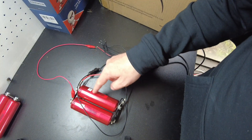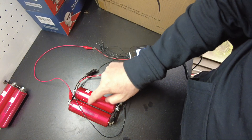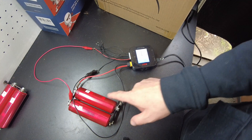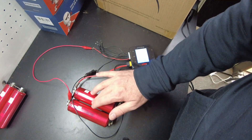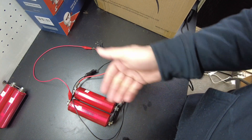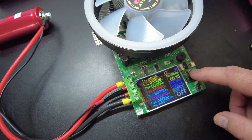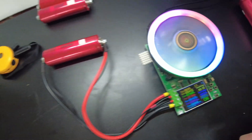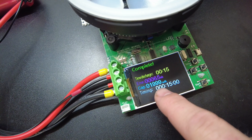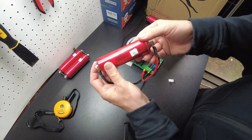I'm also going to do the same test on two more cells. These are two 7.9 amp hour capacity cells. We'll discharge one for 30 minutes at 8 amps and the other for 15 minutes at 8 amps, then put them in parallel and leave them for 24 hours. Set to 8 amps for 15 minutes — start. That one completed: we pulled out 1.999 amp hours. We'll mark this one as the 5.9 cell.